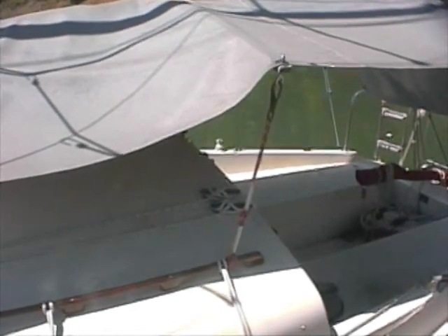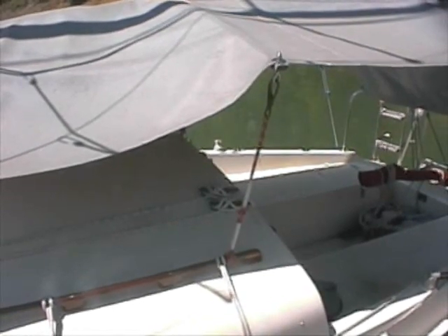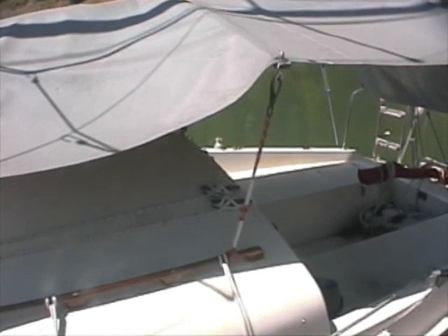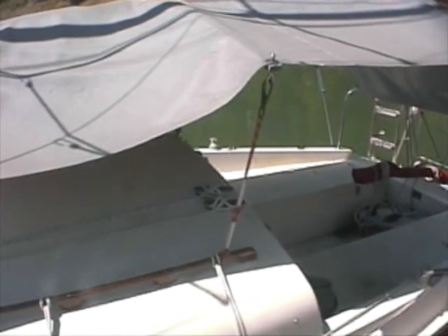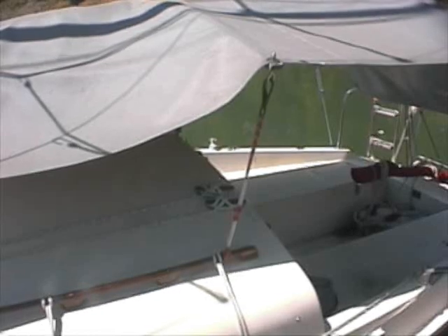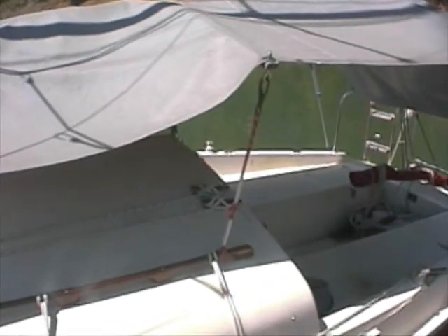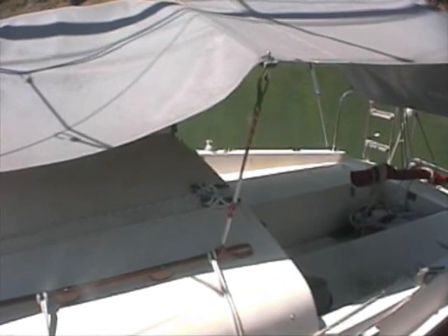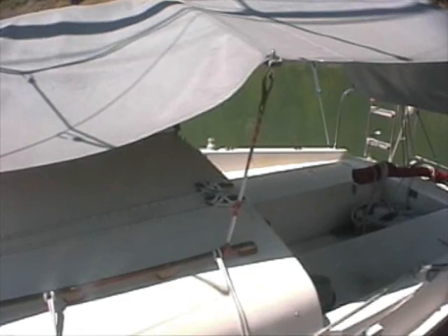The midship spreader bar is a piece of 1x2 oak, epoxy coated. We used the same stainless steel eye bolts, washers, and acorn nuts to form the attachment loop. This time, instead of using a bungee cord, we used a piece of quarter-inch line and a bronze snap hook. The natural stiffness of the oak provides the tension and the proper length of the line gives the curvature that we want.